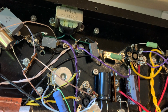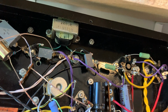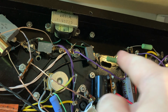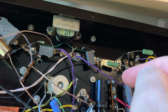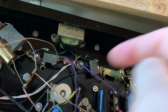And overall there's a benefit in the sound. However, if we wanted to make this amp even better sounding, much faster, much more dynamic, then instead of that resistor, just take that out and put another choke like that right here, so that we get this first capacitor, choke, second cap, choke, and then third cap feeding the input stage.